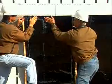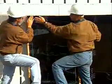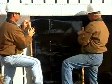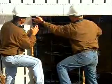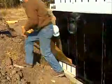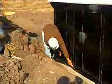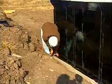Gradually peel off the backing and fasten the membrane to the wall by wiping it downwards as shown. If the weather is cold, you may need to use a heat gun to help the adhesion process. When you get to the bottom, work the membrane around the corner formed by the wall and the footing and continue to stick the membrane down until you reach the footing's outside edge.